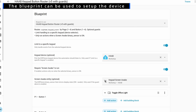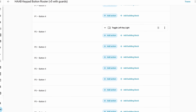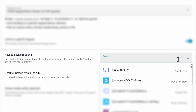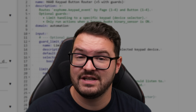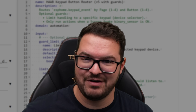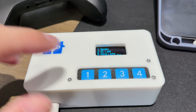To make configuration of the button box simpler, I also created a blueprint which lets you configure and customize the device — controlling what each button does and having them trigger different scenes or automations. Using the blueprint, actions are bound to the unique device, so if you set up multiple button boxes, pressing button one on one box won't trigger the same action on another. There's also a guard action which stops a button from triggering if the screen is off, meaning you have to wake the device first before triggering an action — useful in a workshop setting. All of this is configurable and linked in the description.